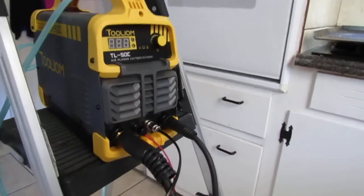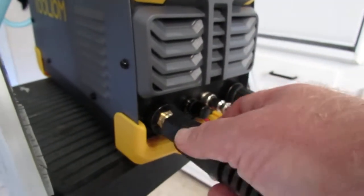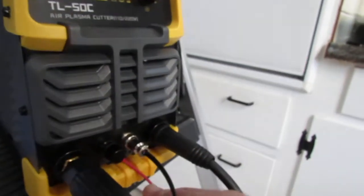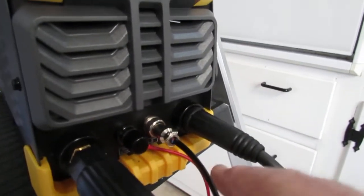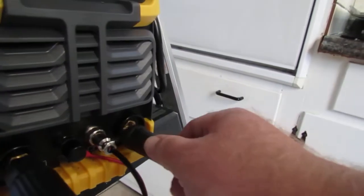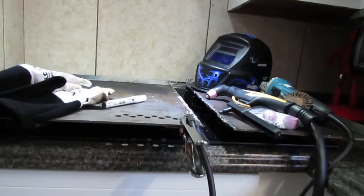This is how it's connected at the front — it just threads in and has a protective cap that threads on. There's a red wire that grounds to this, and this is the control wire. And of course this is the grounding electrode wire that goes all the way up with the clamp to that steel plate.